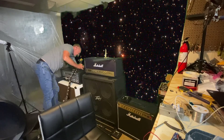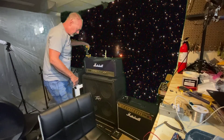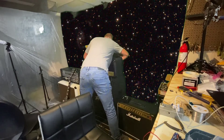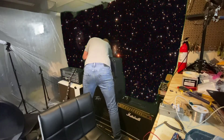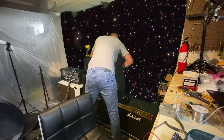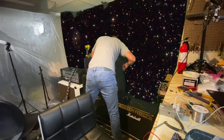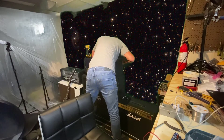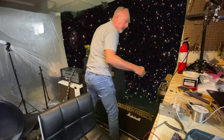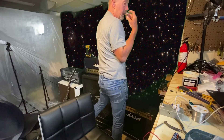Alright, taking out the foot switch and the power and everything. What happened was over the weekend I got a really bad microphonic tube, and I discovered whoever had this amp before me had put in a 5751 - it's right here - a Tung Sol 5751.